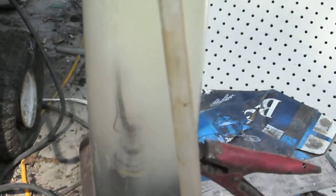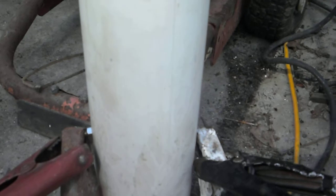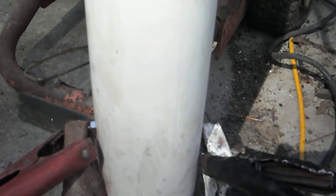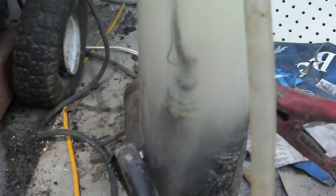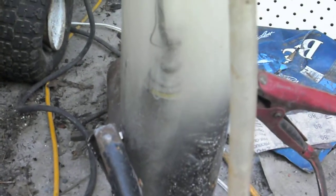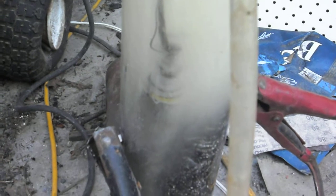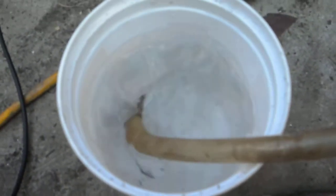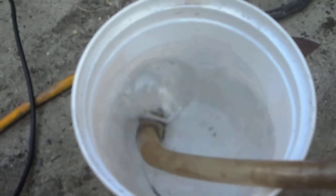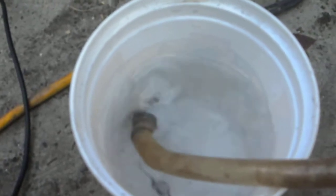This single cell draws 10 amps, and the collective cell is drawing about 39 amps across six tube units — but it draws much less than expected. I guess that could be the conductivity of the wires or not enough connections. The KOH level is identical between the two cells. There's a little bit of hydrogen bubbling — looks like about a liter a minute, maybe two, but I should be making three to four apparently.